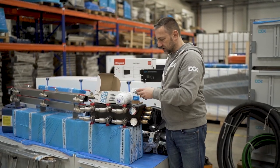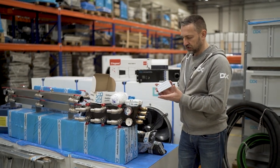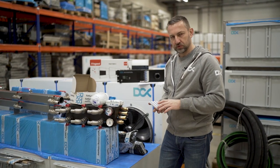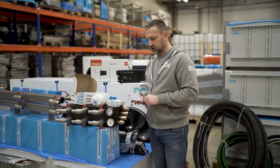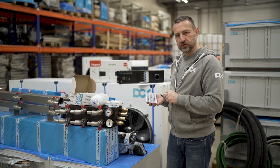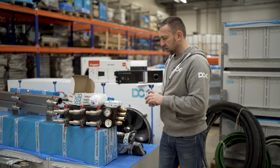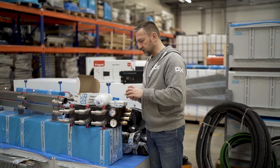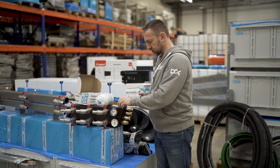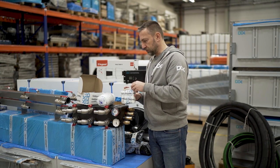The sensor is designed for the rack system, supplied by this small power supply. And we also hide here universal fan emulators. We're using fan emulators to simulate the fans without using custom firmware. It's not always convenient, or there's not always firmware available. So we use those 4-pin, or we also have a 6-pin version of the fan emulators. These are universal, and the controller which is here adapts to the speed of the fans which you are using. So these are one-time purchase components, which also ship with all the packages.